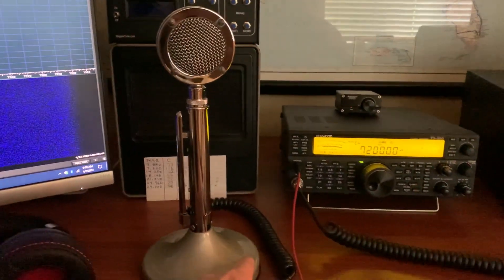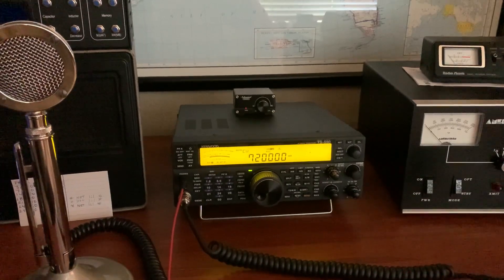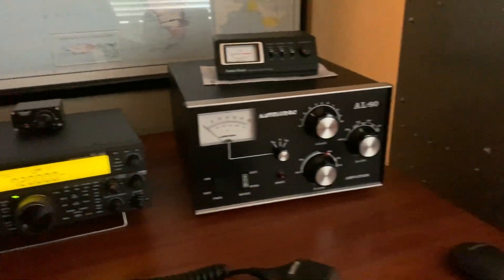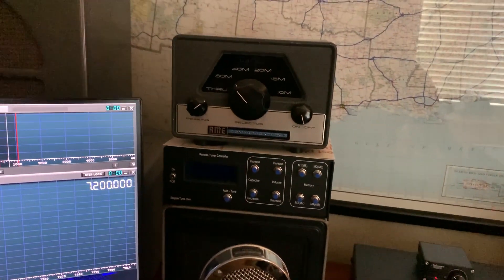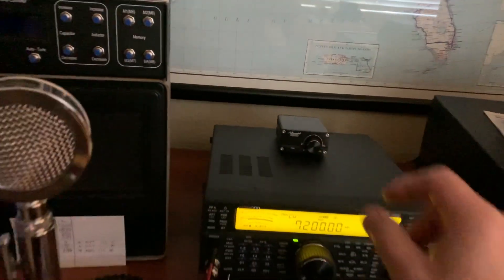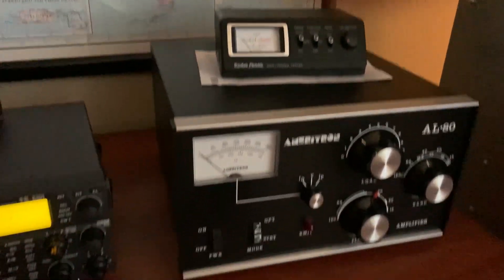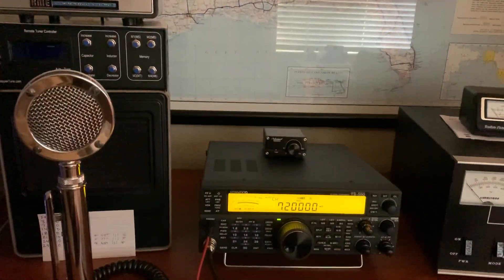If that doesn't take care of all the RF, I'll put one on the output. I'm going to have to toroid all my cables behind the desk — pull the desk out later this week and put toroids on everything and filter the whole thing. I just switched to the dummy load, and this thing was buzzing really bad at full power. But it's not doing it on dummy load, so the buzzing must have been coming from the antenna. It was buzzing bad.